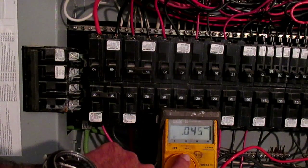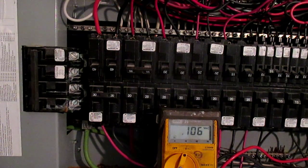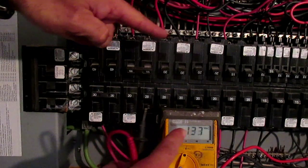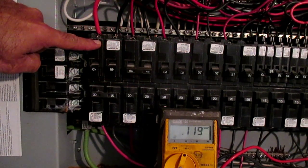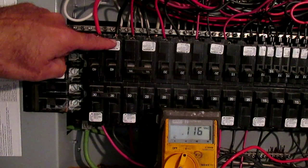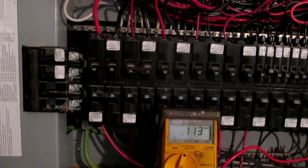Here I have my voltmeter set to AC volts. The little squiggly line indicates AC volts. The basic idea on any electrical panel is that there are two bus bars that run behind these breakers. One is 120 volts from the street — our commercial power — and the other is negative 120 volts. So between the two, that's where you get your 240 volts. If you wire to a bus bar behind these breakers to our neutral, you're going to get 120 volts. If you go between the two bus bars, you get your 240 volts. The 240 volts will feed large appliances like stoves or dryers.